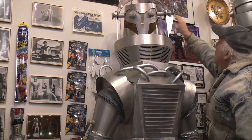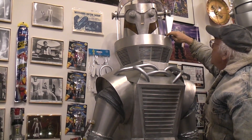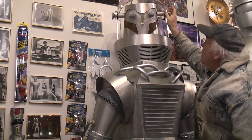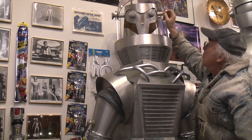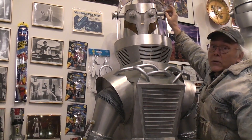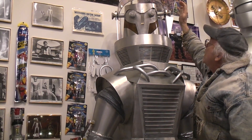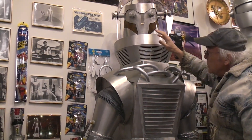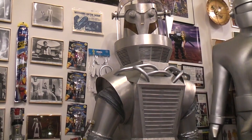There are machined parts on Tobor — like the ring parts up on the head, the main aluminum piece that holds the head. There's some more acrylic on the nose, the acrylic eyes, and the whole acrylic thermoform dome. I had molds of these parts so that I could reproduce and machine them correctly. The dome — me and one other person — made a mold form from the original so that we could then thermoform more of the large mold pieces.